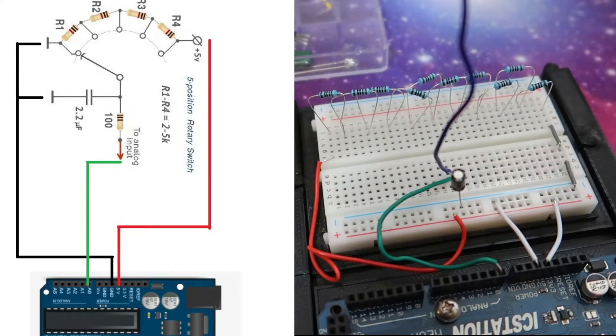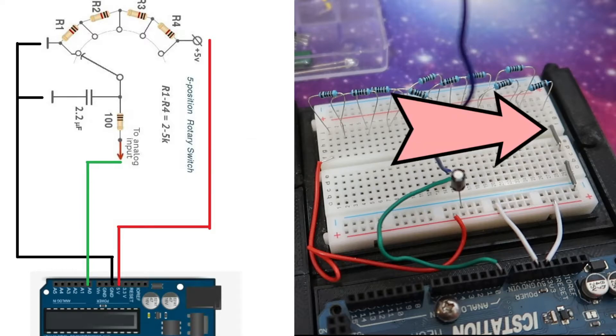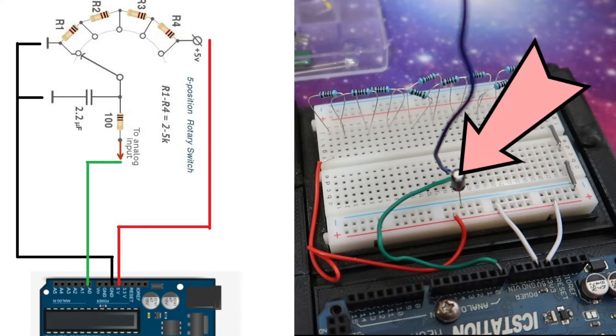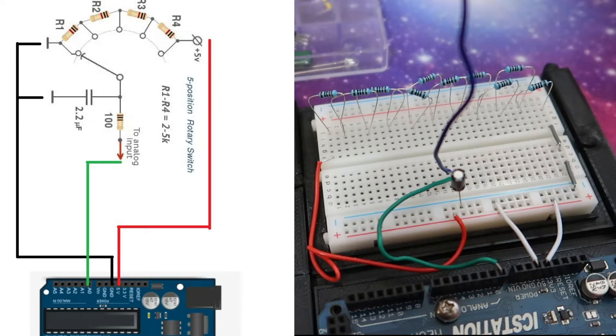So here's the wiring diagram. The 5-volt rail connects from 5 volts to that first resistor. We have our earth connected to the last resistor and also to the capacitor. Then we have that analog input wire, which is also teed onto one half of the capacitor, and the other piece goes into the analog input. I don't have that 100-ohm resistor before it goes into the analog input, but it doesn't really matter too much. If you wanted to, you could add it in — it'll just reflect in your values later on in the code.